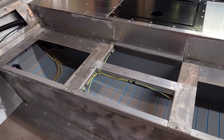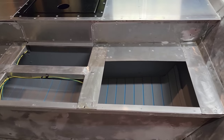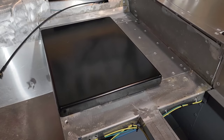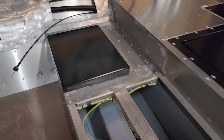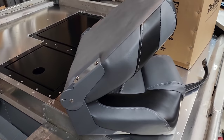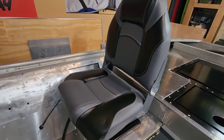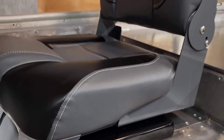I cut holes and wired in leads for the cockpit lights to be installed after HydroTurf. The bench area was starting to look really good. You can also see here where all the leads were wired into the console area. The bench area would also get brand new powder coated lids and new bass boat seats made by Deckmate. I use them for mock-up for now, as these would also have to be installed after the HydroTurf goes down